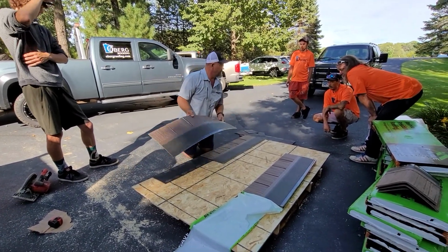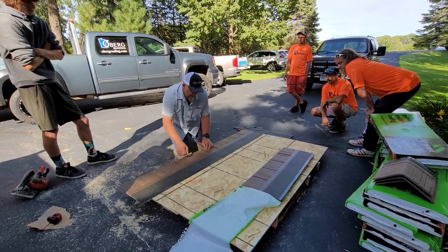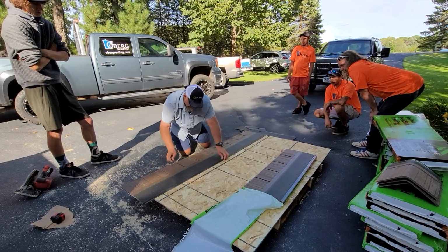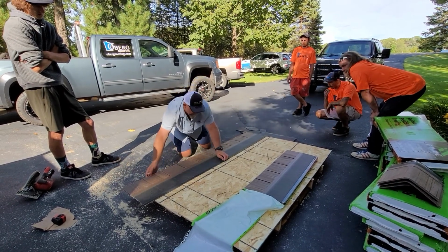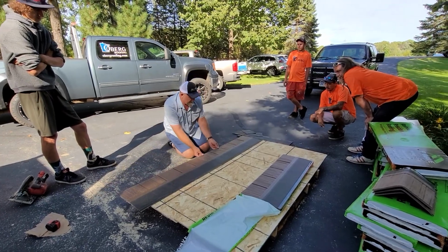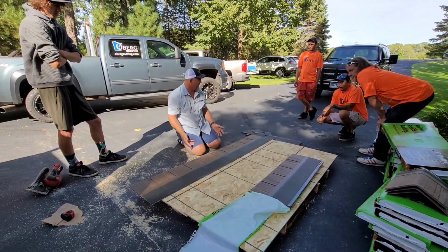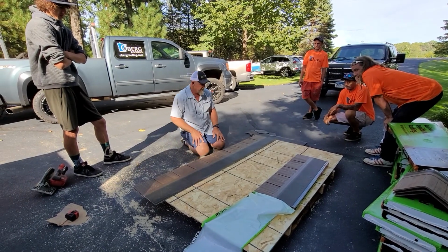Good so far? Take the next shingle, you're going to lay it basically right here, and you're going to do the same thing. 6 more nails. Boom, boom, boom, all the way across, right? This is going to actually seal. If I can push this right here, it'll be sealed to it right now, okay? So you're going to go your 6 nails going all the way across it.